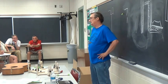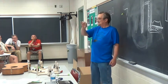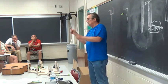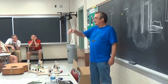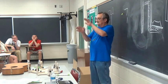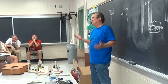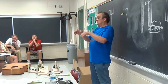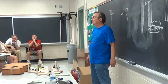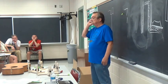What I've been doing is taking a little bit of lacquer thinner and a real fine, almost like a pinstriping bristle about this long. I dip that into lacquer thinner just right at the joint. That softens it enough so I don't have a breakup. I'm going to have to do some finish work, but I'm going to have to do finish work anyway. And this way, sometimes I can save the lacquer on the binding. I would rather drop fill than overspray.